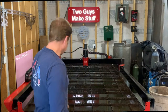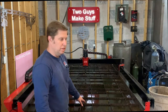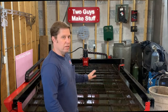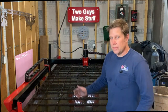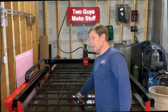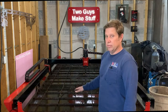It's a 4x8 table. This is called a waterbed, and inside this waterbed are these slats. These are consumables — there are a lot of consumables in this table. These slats are what the steel, or whatever material you're cutting, actually sits on. As you're cutting, the torch goes through the material and through the slats, so these things get beat up. They get dross on them, they get cut, and over time we have to replace them.